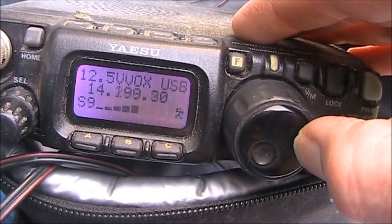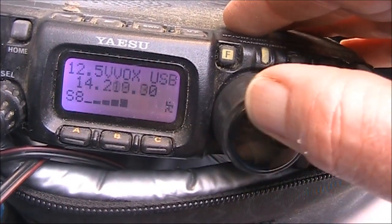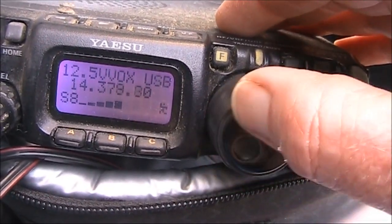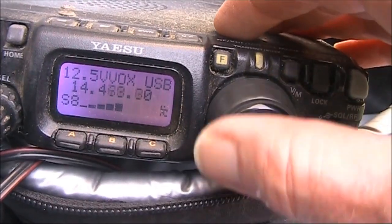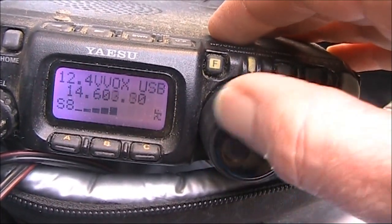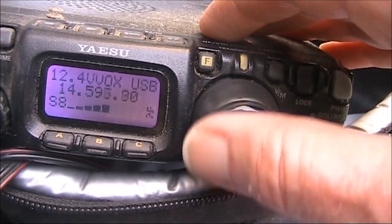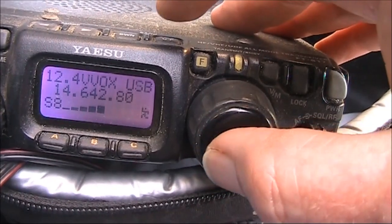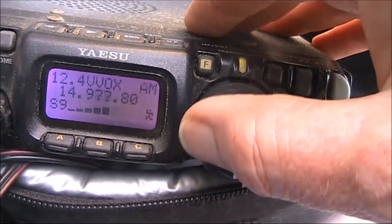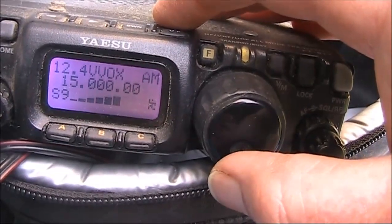The balun is still connected. There's a lot of noise, but signals are audible. Now we'll just go up to 14.6 and see what it says on the S meter — does the signal strength go up or not above the noise? Not really, it's staying on S8. 14.6 should also make it quite a good antenna for the 19 metre broadcast band, so let's see if we can get WWV. And WWV is audible.